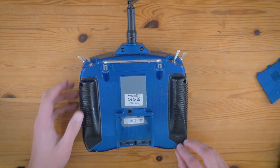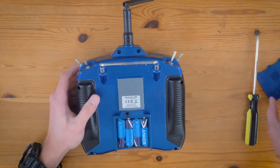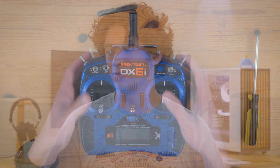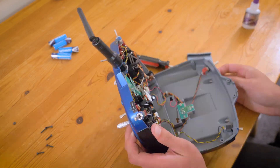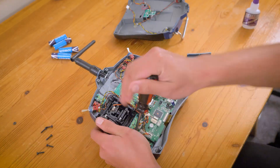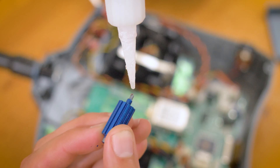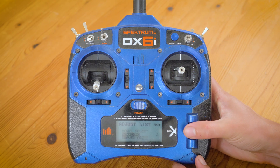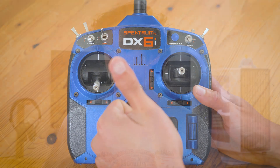Of course there was a screw missing from some point in this transmitter's history, but I turned it on and it actually didn't work 100%. Sometimes the scroll wheel would slip in the encoder, so I took the whole thing back apart. I added a dab of CA glue on the plastic scroll wheel where it interfaces with the encoder, and that little bit of extra thickness is enough to add more interference and more friction to consistently spin the digital encoder itself.